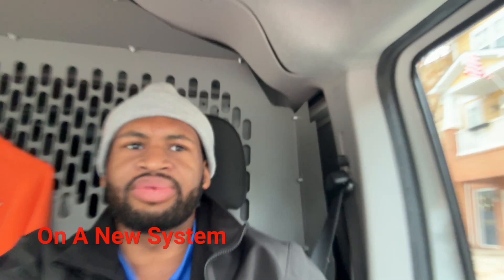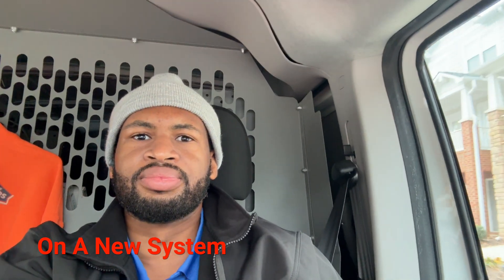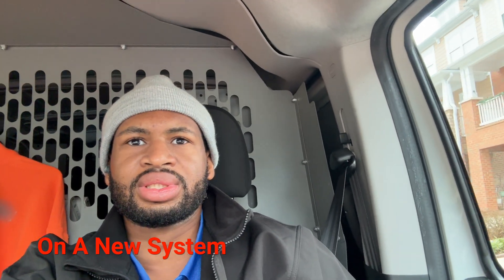Alright, so we just left that call. It's a 2021 80% furnace, and that pressure switch just pooped the bed. After a couple of tests, that pressure switch was just stuck shut — couldn't loosen it or nothing, so we ended up replacing it. That's probably the first time I ever had that happen all year, where the switch just failed. But I appreciate you guys watching, y'all have a blessed day, peace.